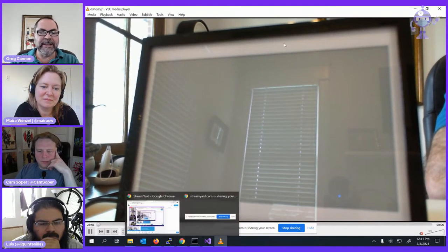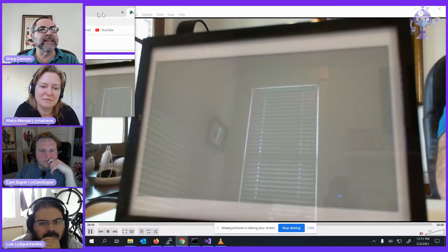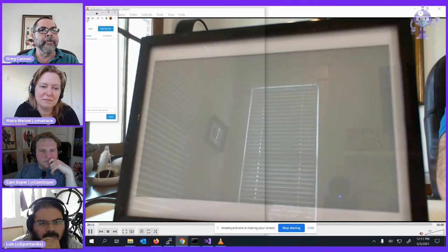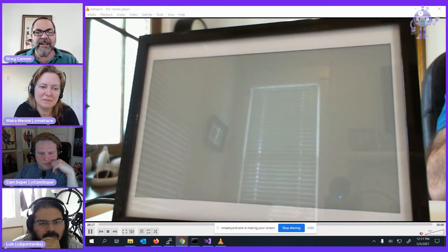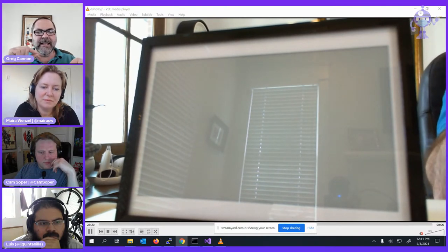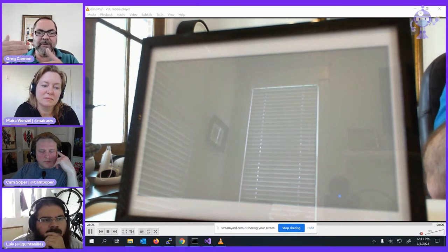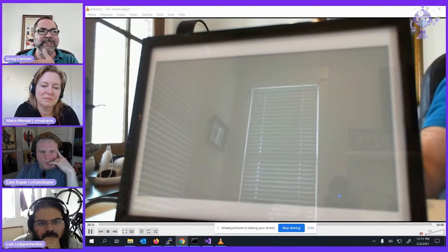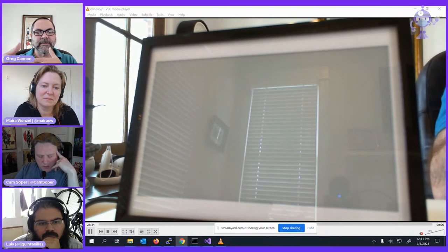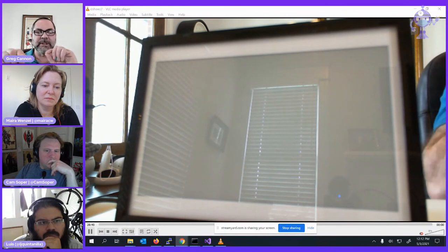And it has some different attributes, I would say, things that you wouldn't typically see with LCD or anything like that. For instance, you've got these little particles of ink in the screen, and it uses magnetic fields to move black ink forward or in, which pushes, I guess, the white ink back. And then it uses magnetic fields to reverse that. So it literally moves these dots forward and backwards on the screen.